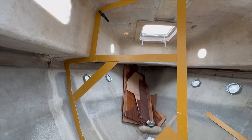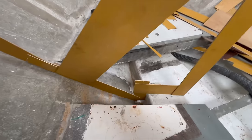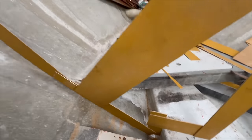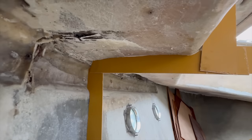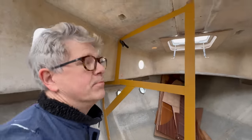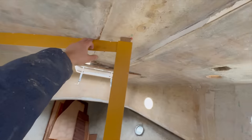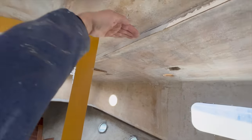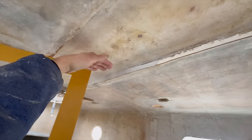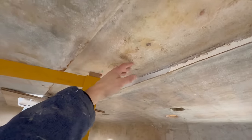The template is done. As we can see, it's quite a tight fit — it's not rocket science but it is okay. I have strengthened it quite a lot since I will have to try to jiggle this out of the boat without it breaking apart. Up here I will have to do adjustments, because there will be another strengthening plywood plate glassed in about here.